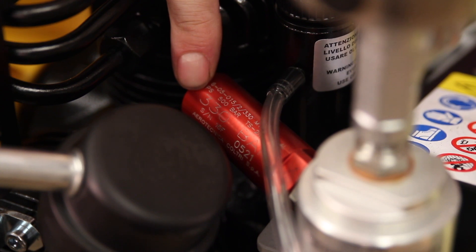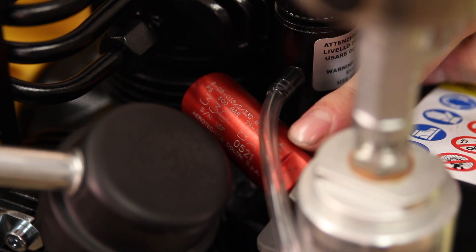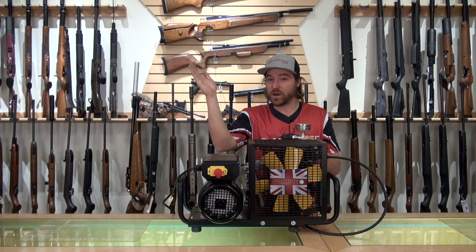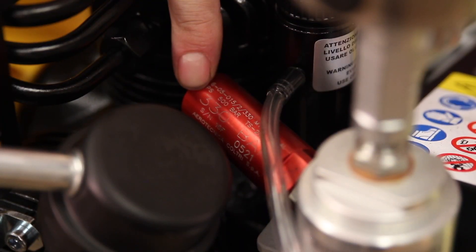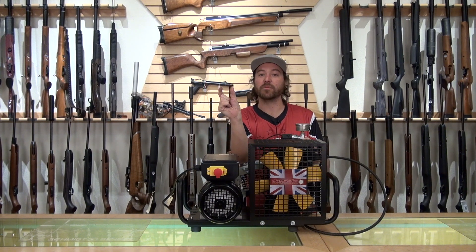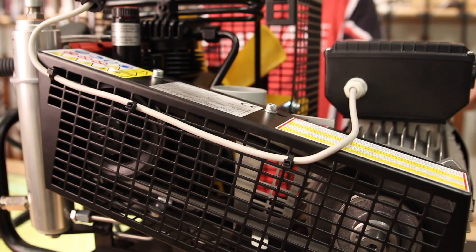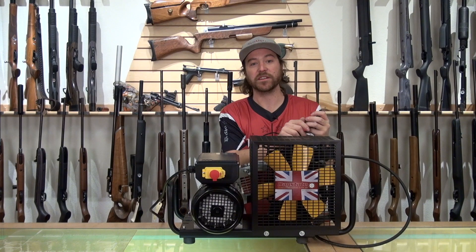These are the safety blow-off valves. In addition to your automatic shutoff, it has what I'd call a tea-kettle valve — all the ones we get are set at 330 bar. So if for some reason your auto shutoff doesn't kick in, as soon as you get to 330 bar — which is about 4,700 PSI — this blow-off valve will release enough pressure to bring you back down. As you build, every time it hits 330 bar it'll just vent the pressure, so you can never exceed 4,700 PSI or cause any damage. The unit has both the auto shutoff and the blow-off valve as safety fail-safes for the end user.